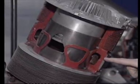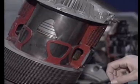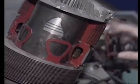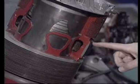Now the inlet port is open and the air is being sucked in. Now the piston is coming around compressing the gas, so the sleeve has moved right up into this junk head region so that the air can be compressed, fired, pushing the piston down, and now the exhaust valve is about to open again.